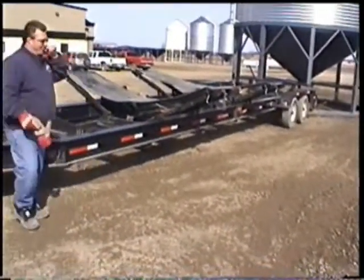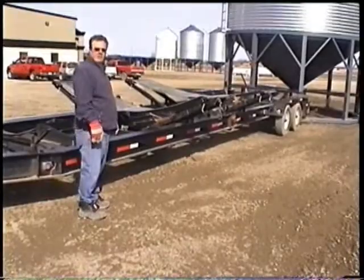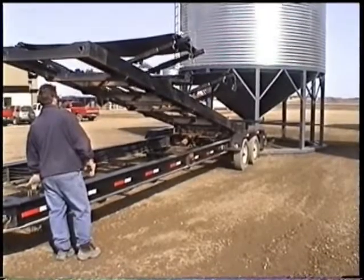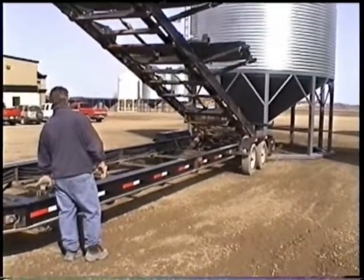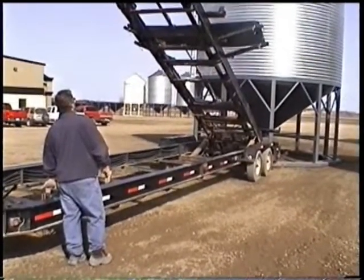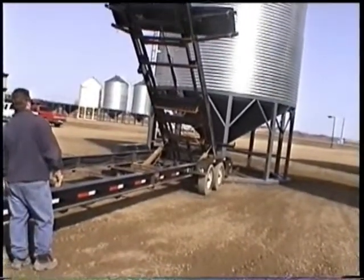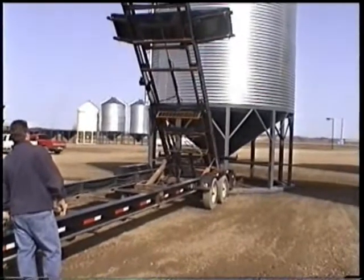The most important thing with hooking up to a bin is getting in position with the truck square to your bin as best as you possibly can. With practice you can get adjusted properly or within reason. We stay a little bit away from the bin to give ourselves some breathing room to make sure we're positioned properly. As we're going up, we have to be careful of red lines and whatever operating instructions you might have. We have our cradles properly positioned for this size bin, and usually when we get to about 80% of the way up is when we'll adjust our cradles to the position of that bin.